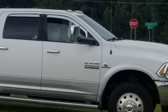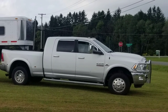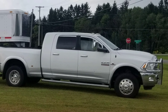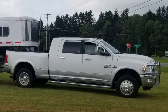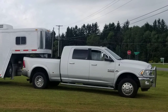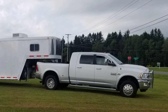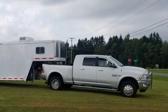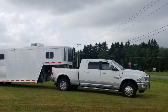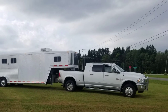Hey, this is my 2015 mega cab Cummins powered truck. I had a problem with the SCR and DPF. I was driving it towing an 18,000 pound trailer full of horses and I lost power - I was going about five miles an hour. I diagnosed it and changed fuel filters, then I put washers in between the DPF and SCR. That made it run better, so I realized the SCR was plugged but I also saw the DPF was plugged. With no luck making them work, I went to eBay and found a used set - a guy had six thousand miles on them and he was a few hundred miles away. I went and picked them up for 400 bucks. I had to convert it to fit my truck. I'll show that in this video - I wanted to share this because there's not much video online of diagnosing this problem.